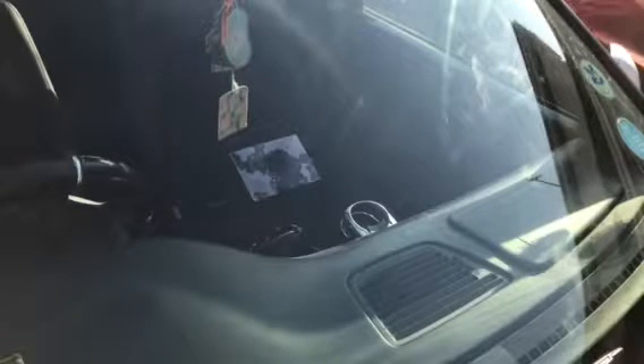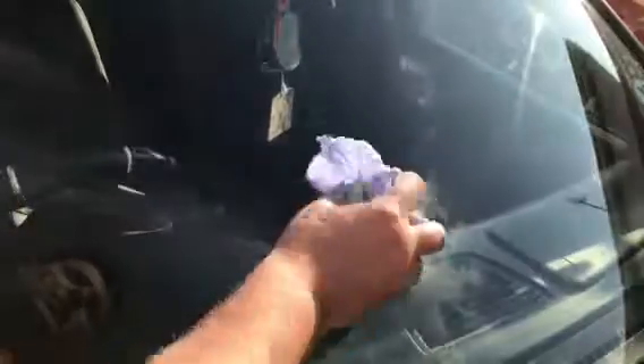I'm going to leave that to cure for about five to ten minutes while I have my dinner. Then when it's been dry, you pull that off, get your blade and scrape off the resin. You can see how tough it's gone. It should have glued the crack together so it doesn't go any further.